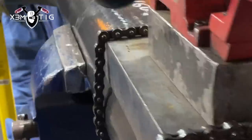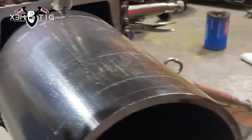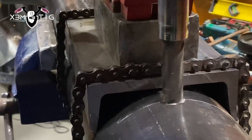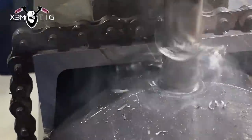Once you set up, double-check that everything is level and squared and you can start drilling. The good thing about a mag drill is that it keeps the cookie inside the drill bit, so it doesn't fall into the line — especially if you're in the field up on the line with no access. You definitely don't want to drop the cookie inside with all those shavings. That's why a mag drill works perfect in a setup like this — it makes life way easier.